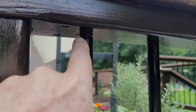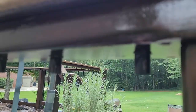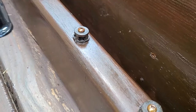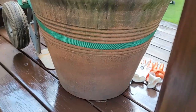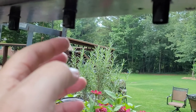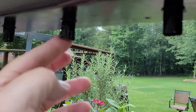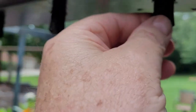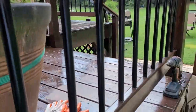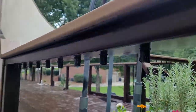Here at the top I ended up putting something a little different. Down at the bottom you can see I've used store-bought connectors for these balusters. But up top I put in a kind of a bolt or screw through it, and then I put electrical tape around it to make a flexible end. That allows me to push the balusters around just a little bit, but it does hold them in place so they won't fall out while I'm trying to put them all into place.